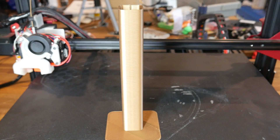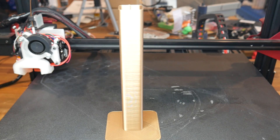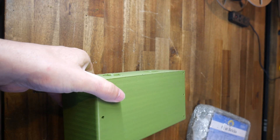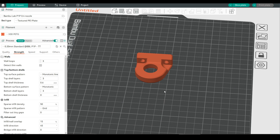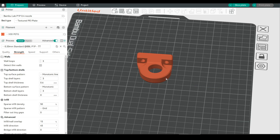My second target, which is very similar in structure to the Ender 3, is the CR10 Max. It's not super obvious, but it suffers from classic Z-banding, with the waves repeating at a set height. For Wobble X to be compatible with either of these printers, you need to be running direct drive; otherwise, the adapter will foul the stepper motor in its stock position for the Bowden extruder. You'll also need to fit a constraint for the top of the lead screw, which is a printable part included on GitHub. If you're running dual Z-axis like me, you'll need to make a copy for the other side by mirroring the part along the X-axis.